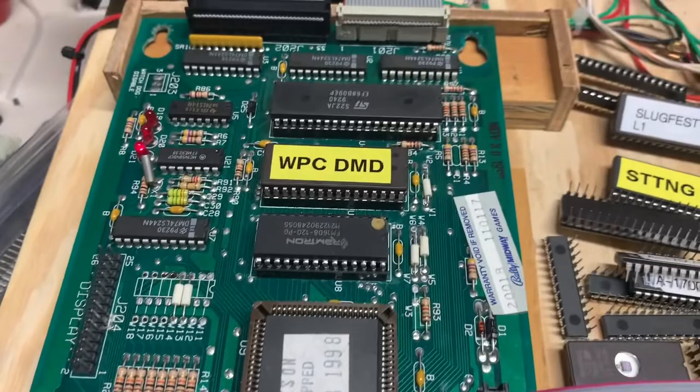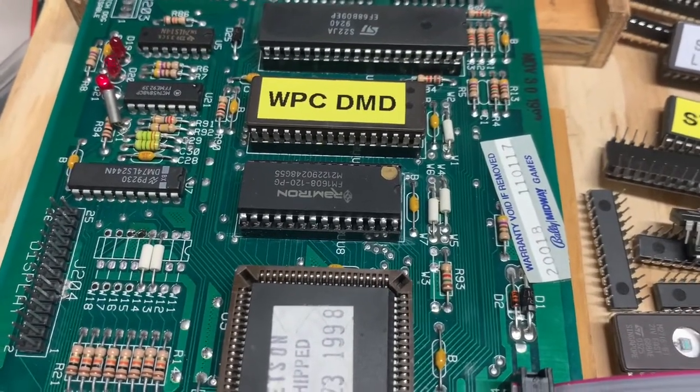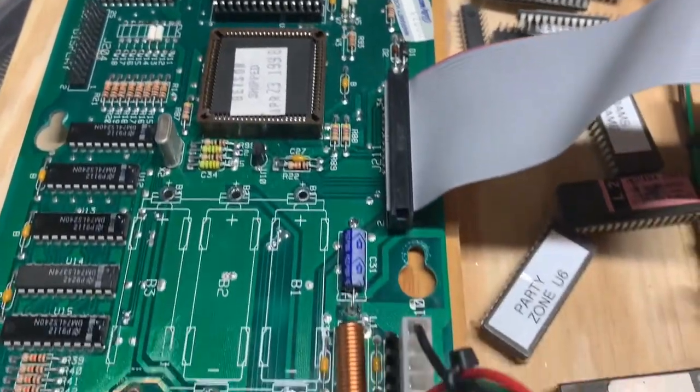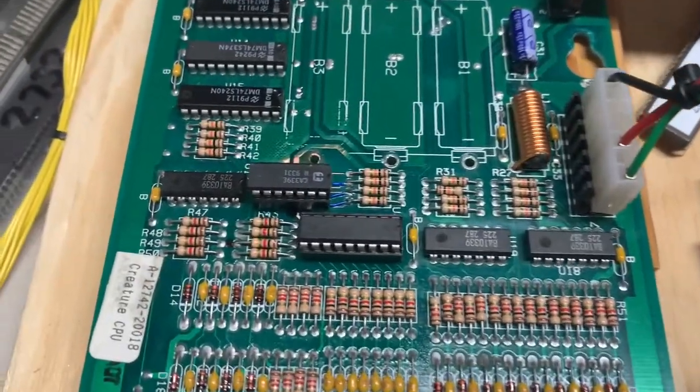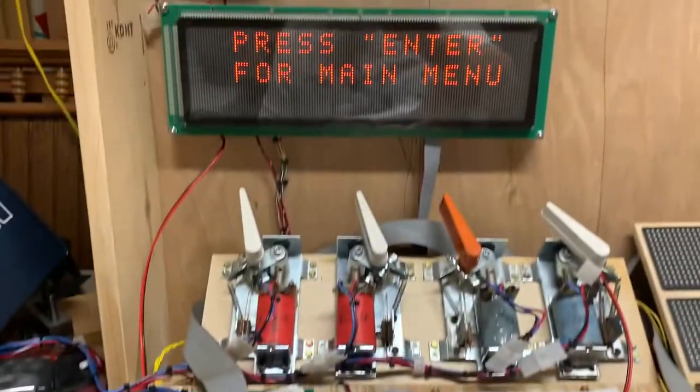I tend to banjo string those, as seen in the picture I just rolled in. I just think it's better to not have a bunch of loose wire hanging off. I've installed NVRAM, replaced C31, J210, standard fare sockets, and now we are ready to test.